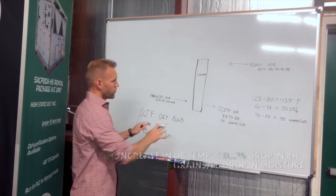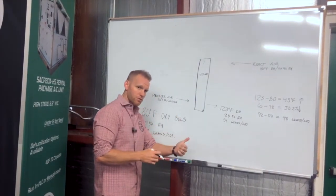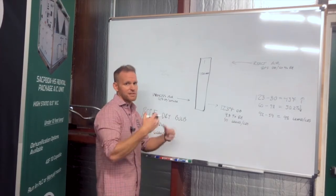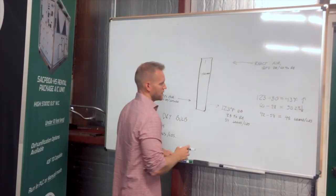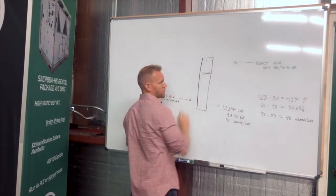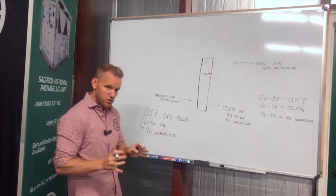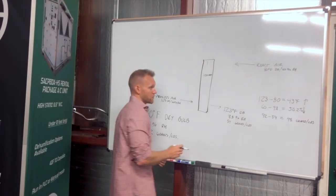That's the typical performance that we could see out of it. It doesn't matter if it's our 2400 CFM or 3000 CFM, 6000, 10,000, 15,000 CFM desiccant dehumidifiers. It's all typically close to this performance when we're using a 400 millimeter wheel. Okay. Now let's talk about what happens on the reactivation side.